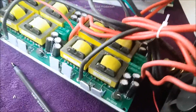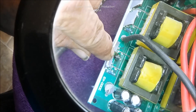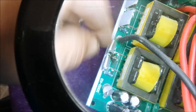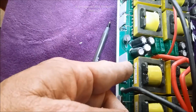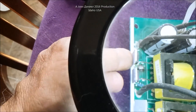The problem with this inverter is that the power supply feeding the MOSFETs has burned out its resistors — those 10-ohm resistors. There's one burned here, meaning this MOSFET failed. The power supply powering that MOSFET uses that resistor. Over here, same story — another burned 10-ohm resistor. All of these are 10-ohm resistors feeding power, dropping it down to about 7.5 volts to feed the MOSFETs' switching. That one also burned out, meaning this MOSFET is bad.